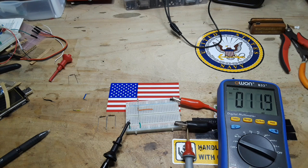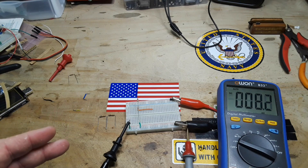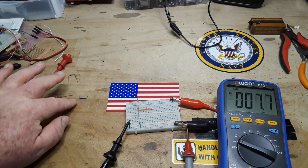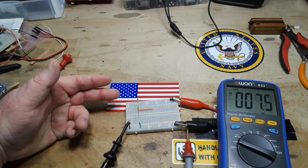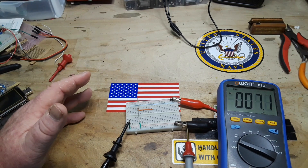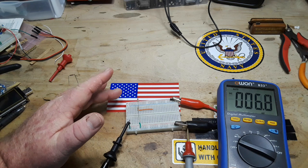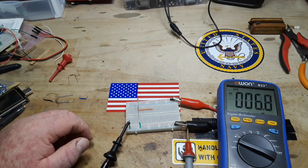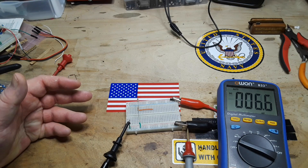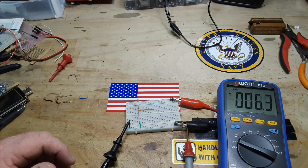Now, as I told you in the beginning, these can be made of any combination of resistors, capacitors, and inductors. However, if you're going to deal with inductors and especially capacitors, that's not going to work in a strictly DC circuit because a capacitor blocks DC. So keep that in mind — those are generally only used in AC or RC circuits. A final question: are they load dependent? Yes. If the load changes a lot, you're going to change the voltage slightly — a fraction of the change of the load — so you won't see a lot but you will see some change. Keep that in mind in your circuits.